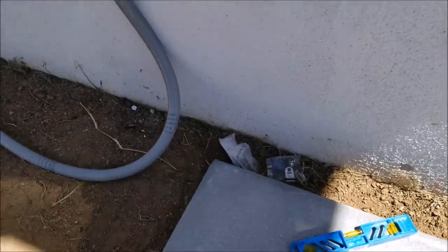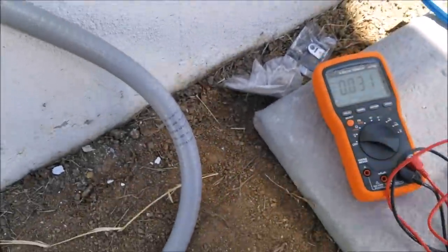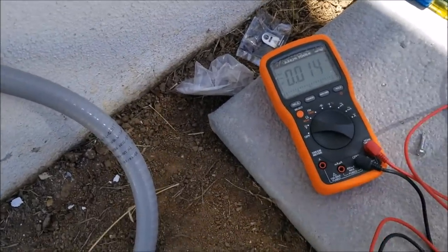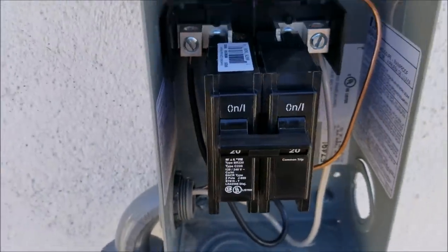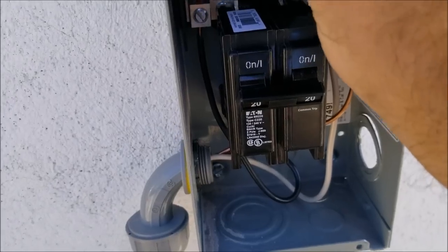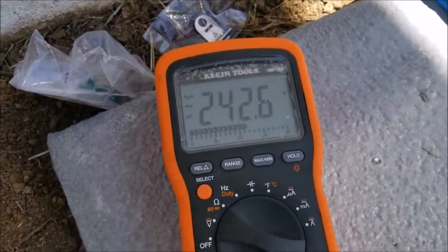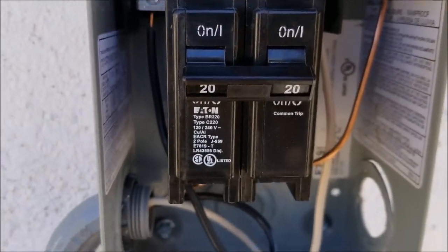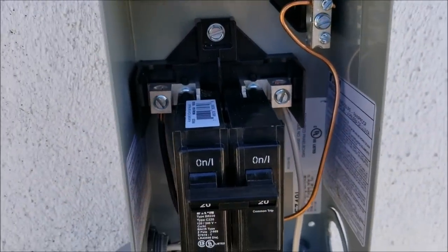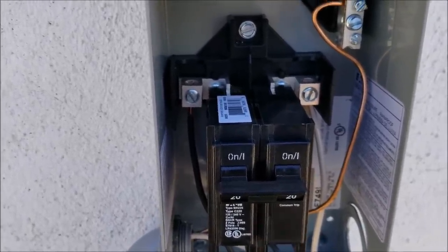This unit is a 240-volt unit — there are some 110/120 units, so be sure to know what your voltage is and use a meter. Be sure to call an electrician or somebody who knows how to do electrical work if you don't know what you're doing — this is not something you want to play with. Basically I'm running it up into this panel. This unit's 240, so I'm getting 240 volts coming through. I tap onto the bottom breakers, and it'll flip if anything's wrong. Check out some videos on wiring or call an electrician if you're not sure.